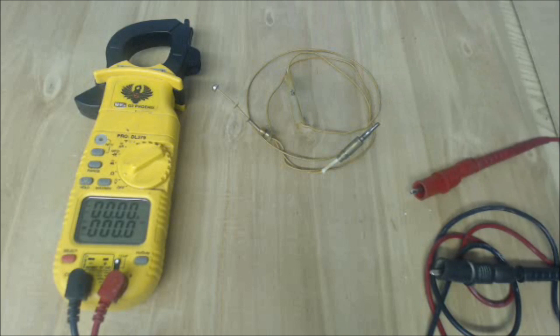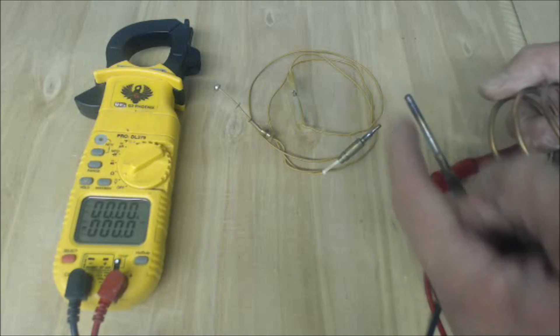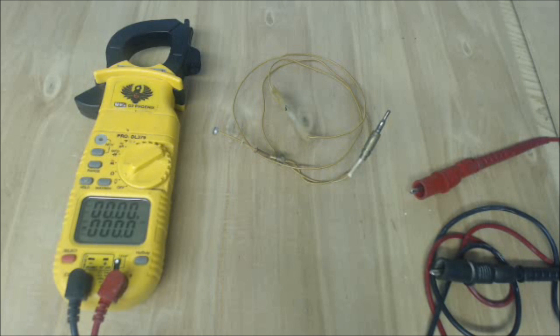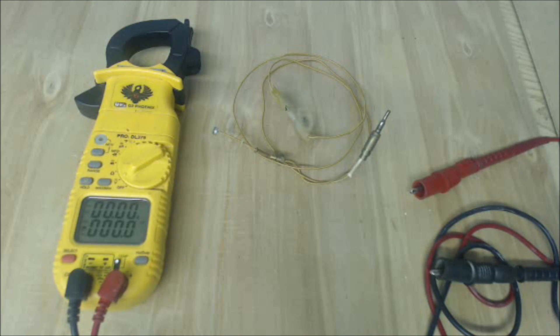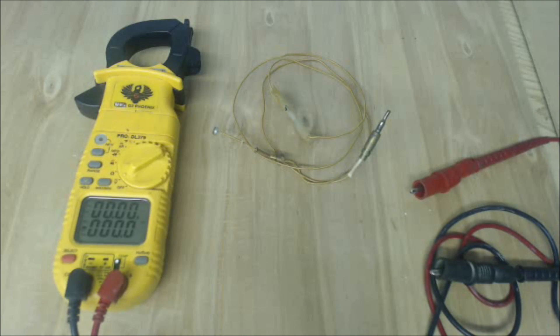It will close the main gas flow for the gas valve. Low mass means there's not as much surface area to retain heat, so you can tell the rod is a lot smaller. Sometimes these will allow a little bit lower voltage, maybe even 10 millivolts DC. But if you read much lower than that, the thermocouple will be bad, or there's soot on the rod, or the flame might not be big enough. Sometimes you can actually adjust the flame height or pressure at the gas valve — it just depends on what gas valve and manufacturer you're working with.